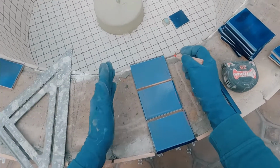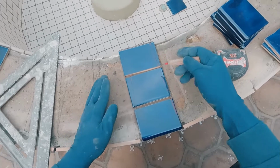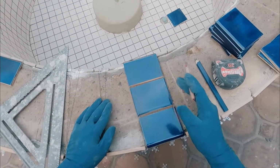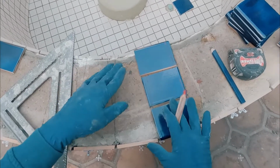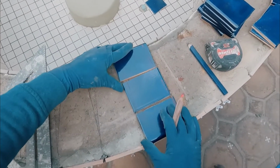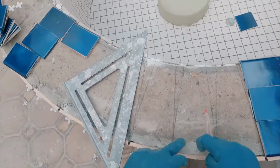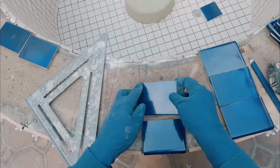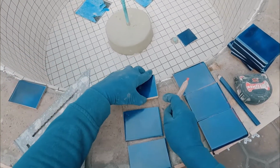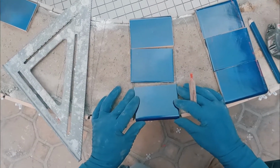Okay, so that's good. So actually, if I cut on a saw from here to here, from here to here, these 3 tiles, stick them in, it's gonna fit perfect. So this one's here. I'm gonna go ahead and mark this row here. I'll cut them, bring them together, and you'll see how nice they fit. So for now, those are marked. Let me just move that over so I could put these here. Okay, go. Same thing, just line this up exactly where you want it.